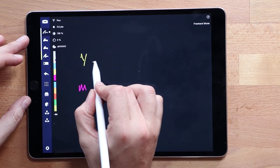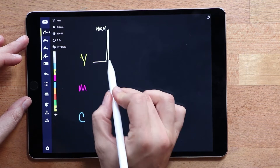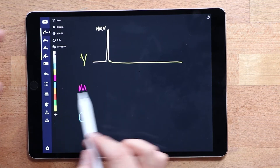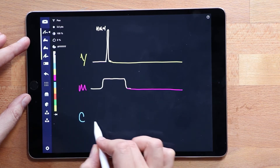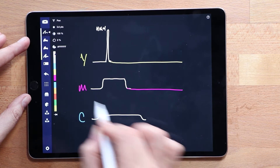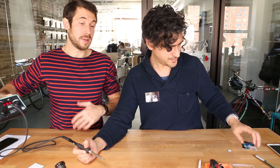Here's the question — if you apply heat, how do you transition one color layer without affecting the others? What if the heat is a combination of intensity and duration? For yellow, we hit it with a high pulse of heat — it goes up to a high temperature and when it cools off, it becomes yellow. Magenta transitions at a medium temperature over a longer period of time. Cyan transitions over a long period of time at low heat. A short high-heat pulse won't activate cyan, and low heat won't activate yellow. For a mixture like green, you pulse the yellow and do the cyan and you get green — different combinations give different color amounts.